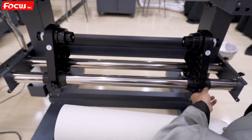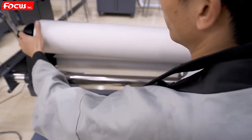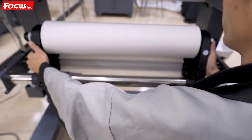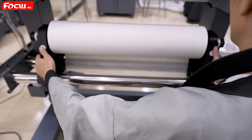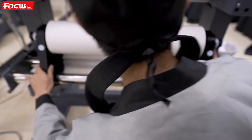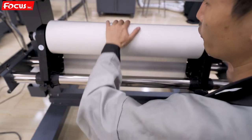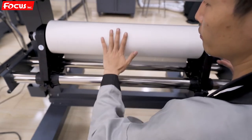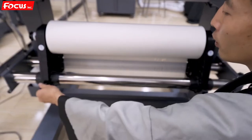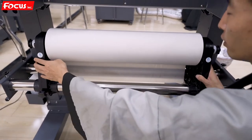So we loosen the roller and we put it on the roller system. We must be sure it's fast and also check the sides position. We must be sure the roll paper is at the middle of the flatbed. And then we fasten it. Be sure it can move freely like this. Then we lock it for the two wheels to make sure the paper will not loosen, not shaking, not bending.